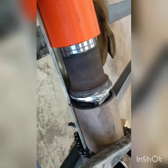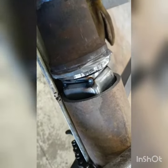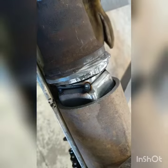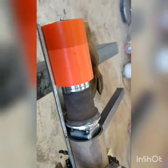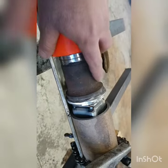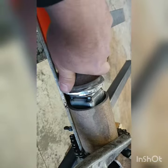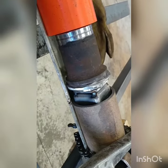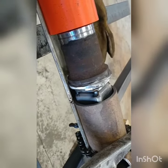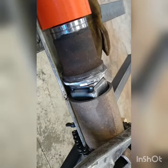So if I'm careful with my heat distribution, and I'm gonna be, then this should remain pretty true. So I'm a little concerned about the plastic heating up. Maybe once I start welding in it real good, like it's already a little warm just from those little tacks. So you know, we might weld it up, let it cool, check it, something like that.